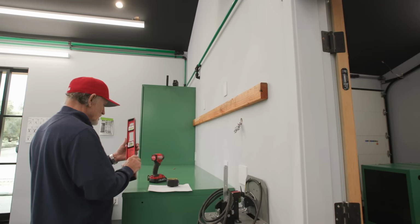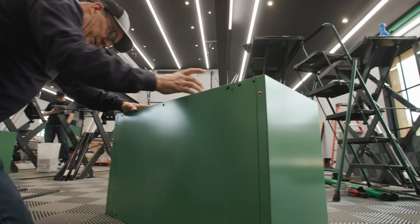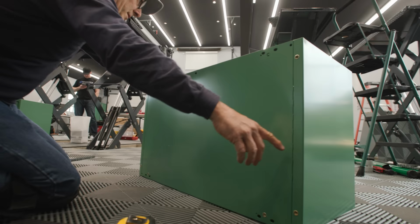No. Not that I can think of. It's level. Okay. Check. Only out for our outlets here. Took those dimensions that I measured off of the outlet box. So we're 22 7/8 to here to 25, then we're 3 1/4 to 7.